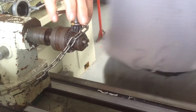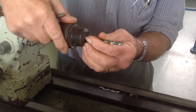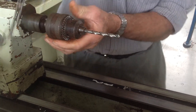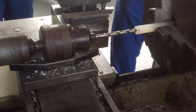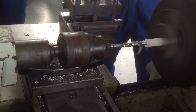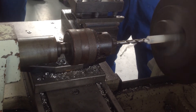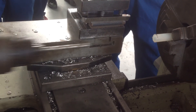We then change that centre piece for a drill — the right size. This one is six and a half millimetres. Bring that in so it just touches, lock it up. And then we need to go four turns on the handle at the back here. One, two, three, four. Line it back, and then we lock. Unlock this, bring it back.